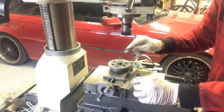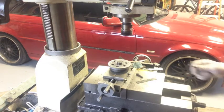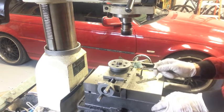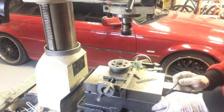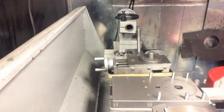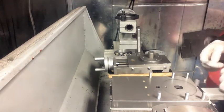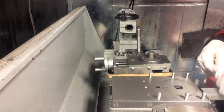These are the original holes and these are the new holes and they've threaded in. So all I need to do now is shorten these bolts, thread them in, and then I can put everything together. I've got all the pieces finished so now I'm just going to assemble it and talk about it a little bit as I assemble it.